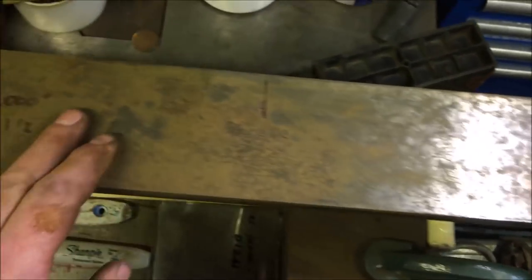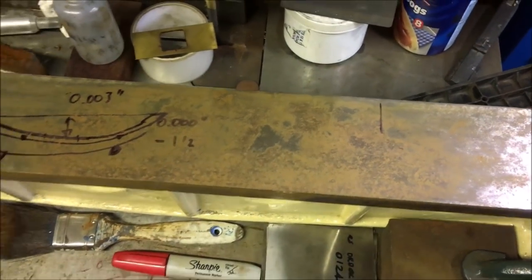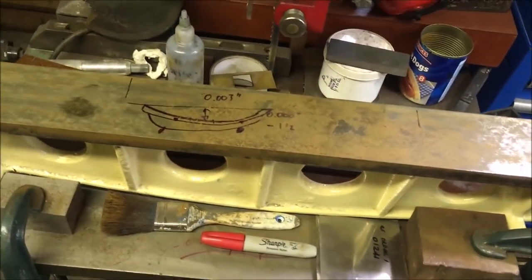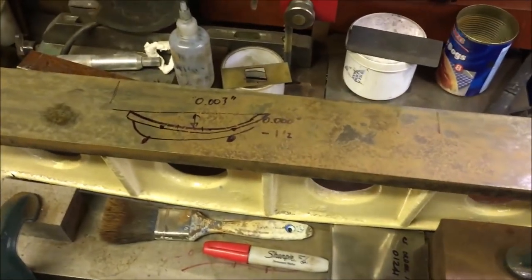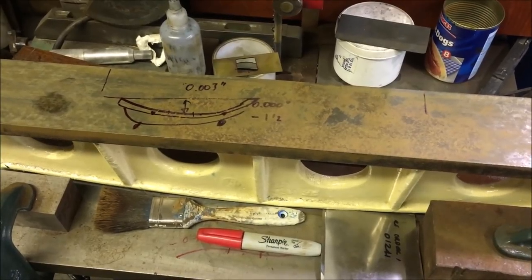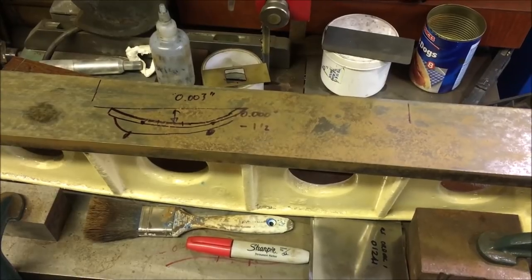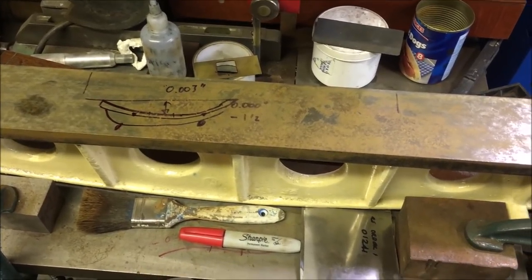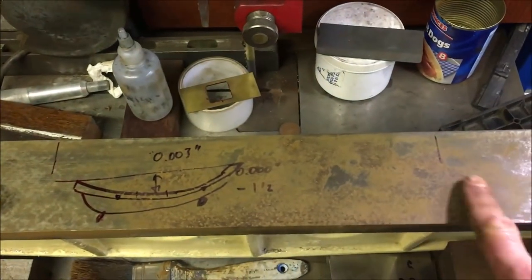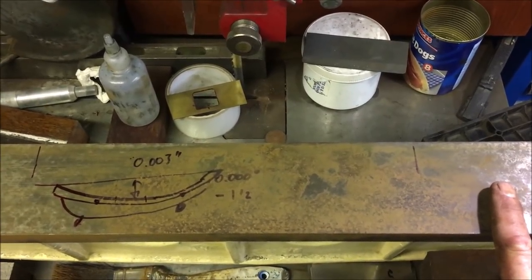But that's the worst bit. I watched Rob Renzetti. I think he put some silver solder into the bottom of Tom Lipton's machinist level when he was scraping that, mindful of not getting any heat distortion. So with the pitting just localized in a small area, I could do that. But this is best part of 30% of it. But I do think with a skim over it, it would probably come not a million miles off.